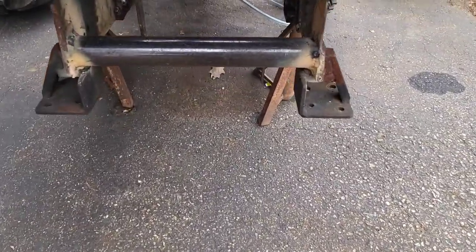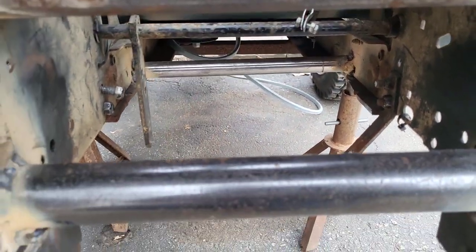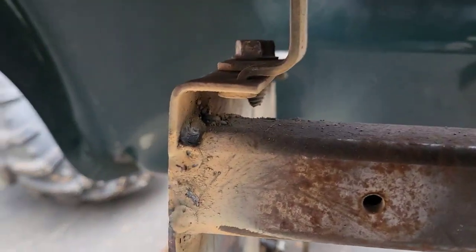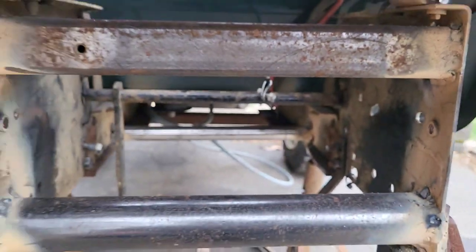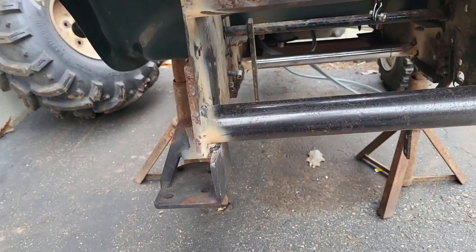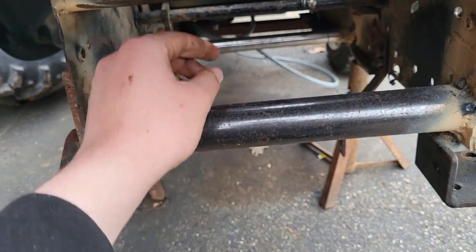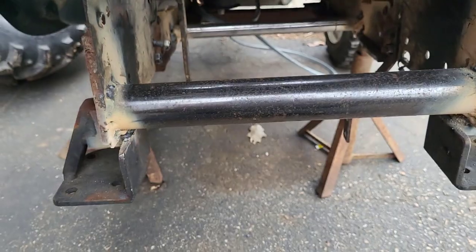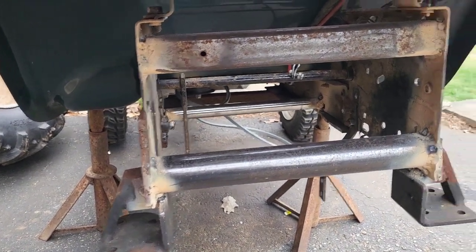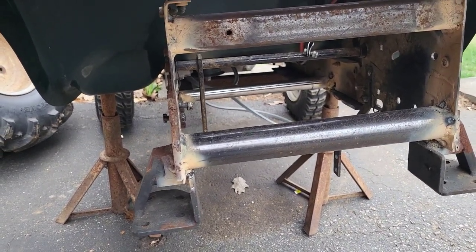In a short time later I got all the braces welded in — welded them nice and hot. That brace with the go-kart axle part was a giant pain because of how tight it was, but I got it in there. I'm fairly confident with this new setup because before, you could grab this frame and you could flex it with your hand — now you can't. Unintentionally, this pipe right here acts as a belt guard for the pulley — there's about a half inch of gap and just enough room to sneak a belt through, so it actually works out fairly well.